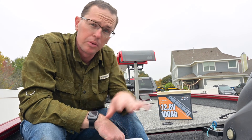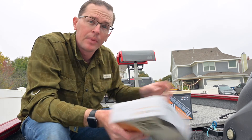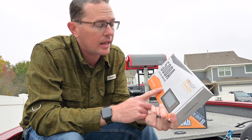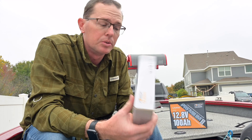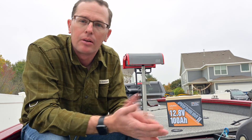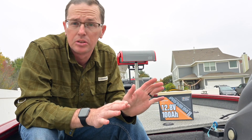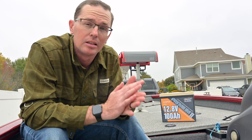What's going on everybody? I have a new toy to share with you that's going to pair up well with my 100 amp hour Power Queen lithium battery, and that is this 500 amp battery monitor. When you run a lithium iron phosphate battery you can't really use voltage to determine the remaining capacity of that battery — the discharge curve is just too flat. Once that battery hits 12 volts or so it's going to drop off pretty much to zero, so you really need to use a different way to monitor the battery.